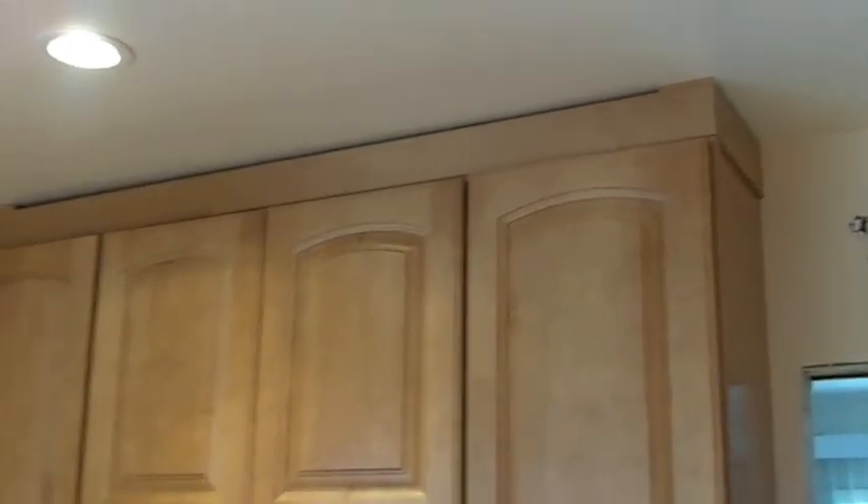I also got all the filler pieces put in place. I had to put blocks in because this wood was shaped like a U right out of the factory package. I had to put blocks in here and custom cut those to fit against the ceiling. So when I glued and pinned these in place they would hold. I'm just going to leave those blocks there — they'll get hidden by the crown mold.